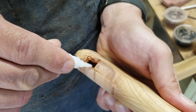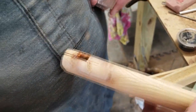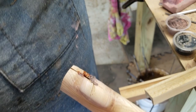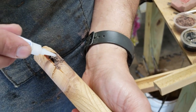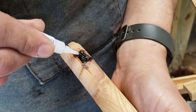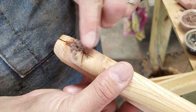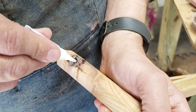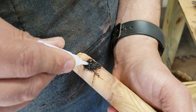What I've done is outlined the wood where the hole is there, and I'm going to fill it with my mixture here, because the mixture more or less resembles a knot in color — knots are usually darker and they usually tend to discolor. One of the chunks of carbonized wood actually helped to seal the hole, so that's kind of a good thing. We'll just fill this up a little bit more. It's best if you're doing this to try to get it to mound over. One thing you want to be aware of is if you push it, it'll go down inside of the flute and start poking through the inside, and you'll have to sand that off as well — which is not really a bad idea, just more work.